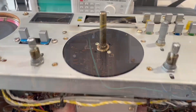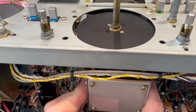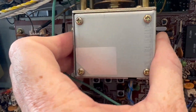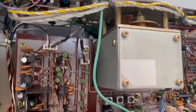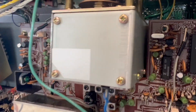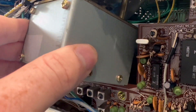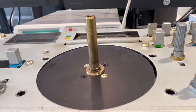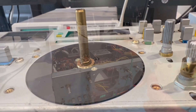Let's get to the VFO. The VFO drops down and the bulb is all the way at the back. They didn't build this so that you could replace it easily. The VFO is held in by a subframe, so most likely we're going to have to drop this PCB, which is the front end. There are lots of issues here with this chassis, so I'm going to put it back in place and study how to approach it.